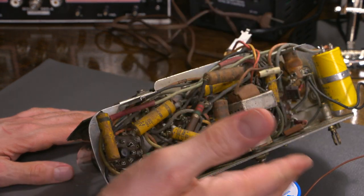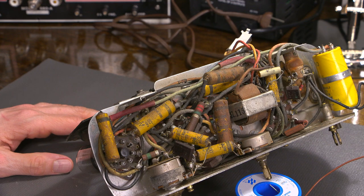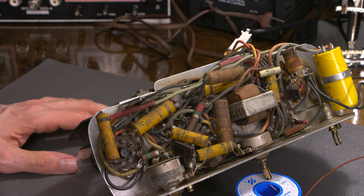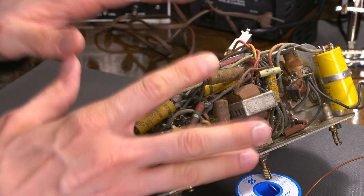It was working and the hum wasn't too bad - there's a fair amount of hum there. But of course, knowing that all the capacitors and everything have to be replaced at this point, that's pretty obvious. One of these capacitors in here is definitely trying to short - that's what caused that dial light to flash. I'll take you around to some different components and show you what's actually going on that's causing this radio to fail - and what would cause it to probably fail in a really bad way if left alone.